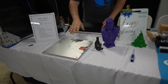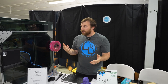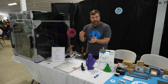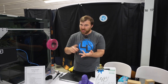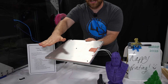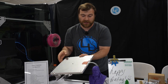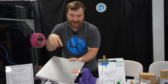This is something that a good friend of mine, Provoke the V — also known as Boxy — has done. Fun fact about heaters: a lot of us glue them on and seal them with RTV just to make sure they don't fall off. Well, over time that may and has failed. So if you want to guarantee reliability of your heater pad, make it last longer, make sure it can't fall off and start melting other things, or if you want to go higher temp — like 150 to 200, maybe 250°C — instead of using adhesive, you clamp it between your bed surface and an aluminum plate. That holds it in place, keeps all the heat where you need it, allows you to hit those higher temps, and ensures much safer operation. And instead of having the thermistor on the back of the pad, you drill it into the aluminum where you're actually measuring the temperature in use.